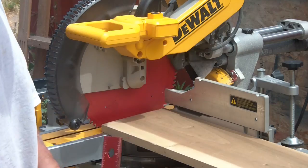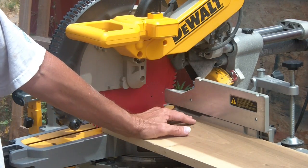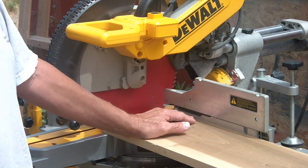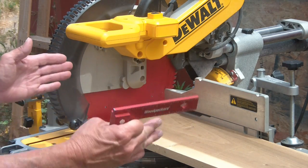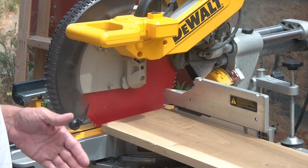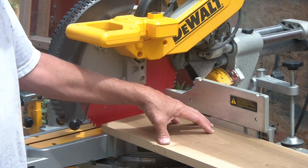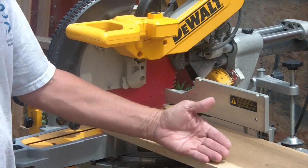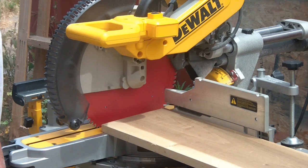That's it. I have a piece of poplar I had sitting in the shop for probably about 4 or 5 months now. I'm gonna use it for the drawer fronts. I got my list, I'm gonna cut them to length, take it to the table saw, cut one side and then cut the other side to width. Then I'm gonna angle the blade 20 degrees and just shave off a little all the way around, give it a little profile. And then we're gonna mount them to the drawers.